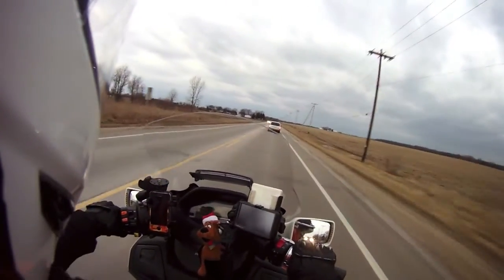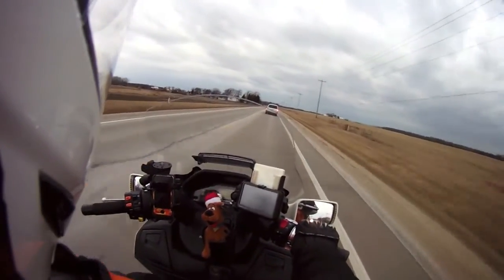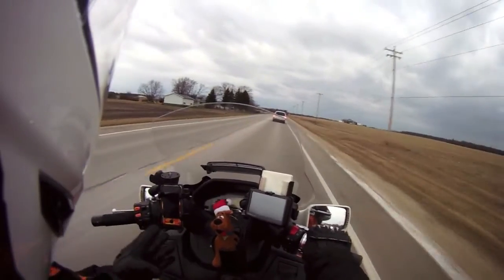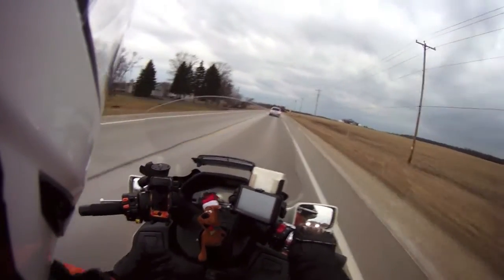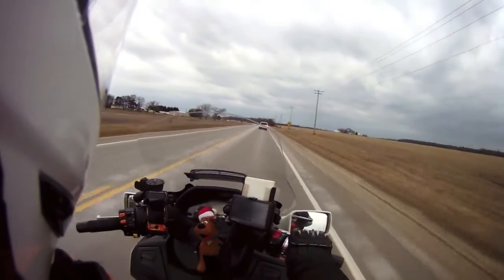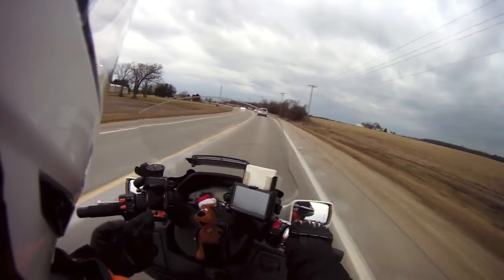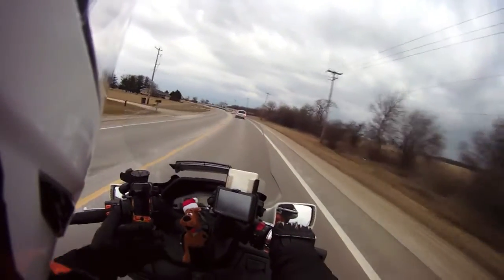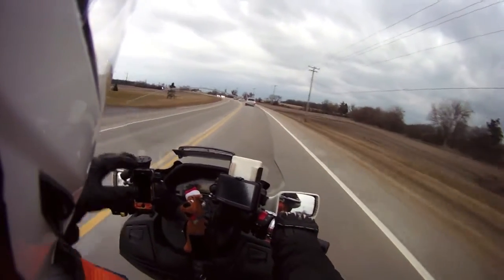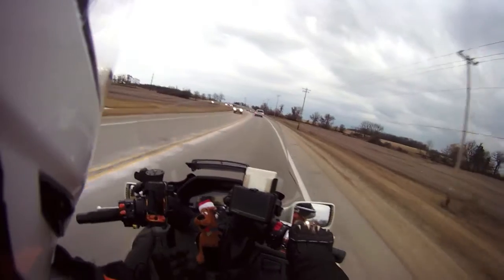Once the pump was working again, I drained it all the way to the bottom and turned the pump off. The water was coming into the well and once it got to a certain point it actually stopped coming in — the water level stopped rising. It did the same thing this time as the first time I tested it. So the water wasn't actually coming from outside the well. What had actually happened is the water on the foundation was basically coming up wherever there were cracks — the concrete slab that is our basement floor, it was coming up through the cracks.